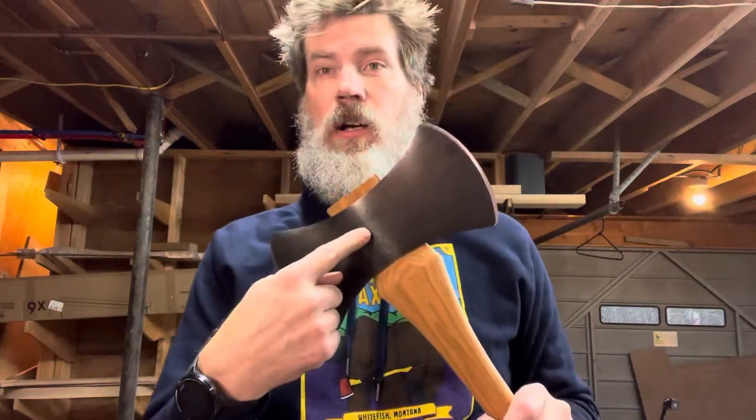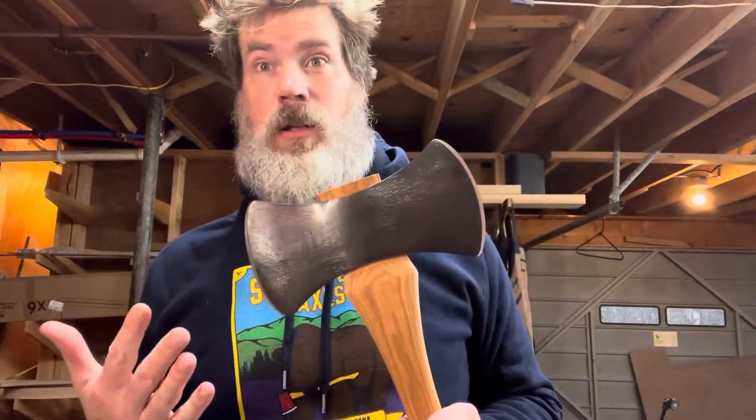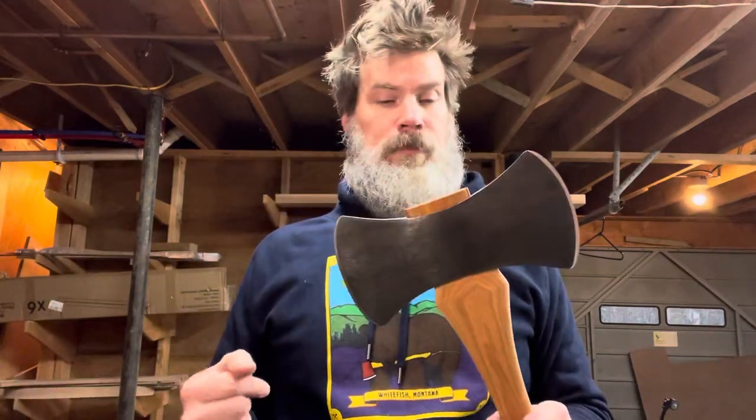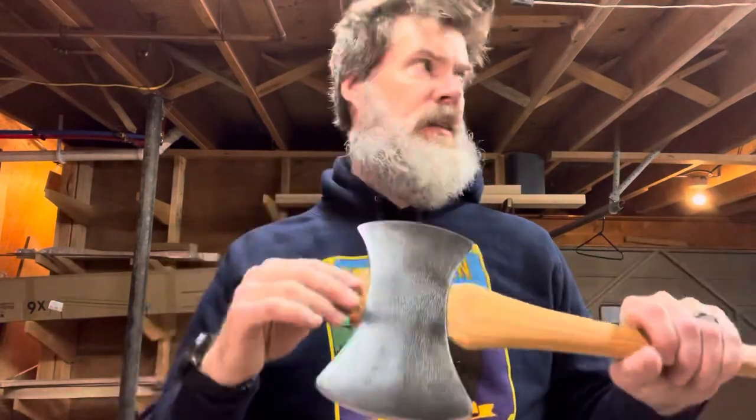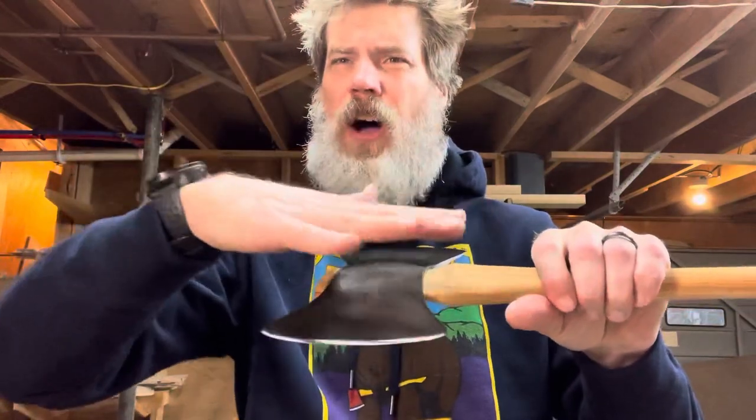Initially I was going to just do a brushed finish, which I'm still working on — comment below or send me an email if you've got a great brush technique, because I'm still trying to learn that. I've got it down a couple of times, but this time it just eluded me. So I started with about a 36 or 40 grit belt, then I was going to take it to a resurfacing belt to push it down and fog it up a little bit. It just wasn't coming. I tried a couple of different grits — 120 grit and Scotch-Brite — and it just wasn't getting the effect I wanted.